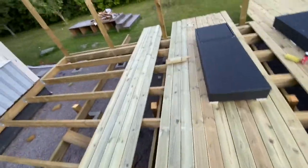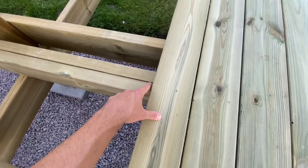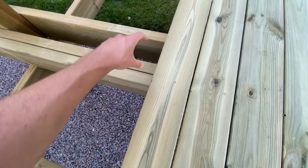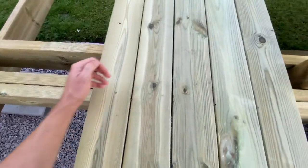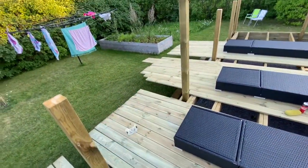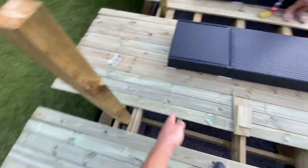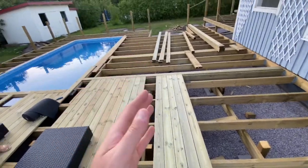What I'm doing is leaving it to overhang for now, and then I'm going to cut it off — probably more like in the middle of this line here. Then there'll be two boards that go that way to do the picture frame. You basically just snap a chalk line and then use the circular saw on the track to get a perfectly straight line. These ones I just need to cut boards to that length to go in there.